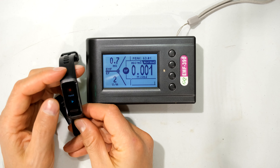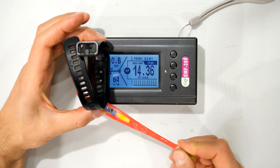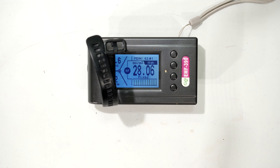I'm ending the training session. The training session has now ended. Putting the watch back, not much difference — you can see it hovering around 52 to 53 continuously and the meter picks it up as high. The reason I've put this so close to the meter is because this would be sitting directly on your skin. If I lift it up by even one centimeter — you can see I can put a toothbrush in there — it drops significantly because of the inverse square law. But because it sits right on the skin, I'm resting it on the meter, and there it is — fairly high.